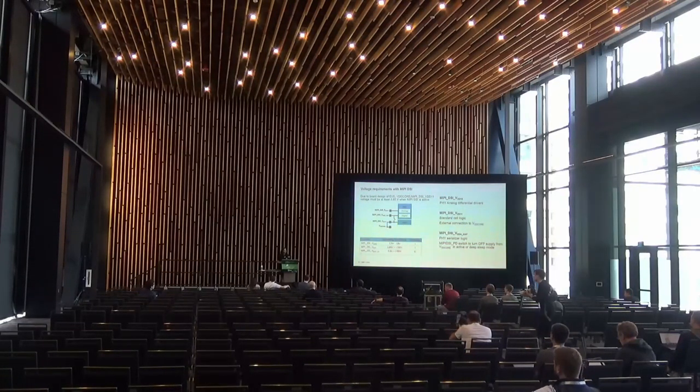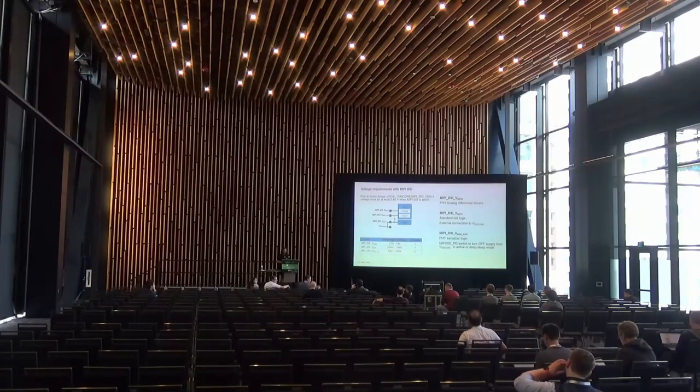So in this demo, I was trying to demonstrate how we can use the already available hardware. If you have different hardware, you can try to leverage those hardware features using Zephyr. That was the goal. I meant the RT500 has the PVT sensor. But it looks like you're turning that on at the application level. The config is smartwatch PVT enable. Is that in the application or in the system on chip code somewhere?